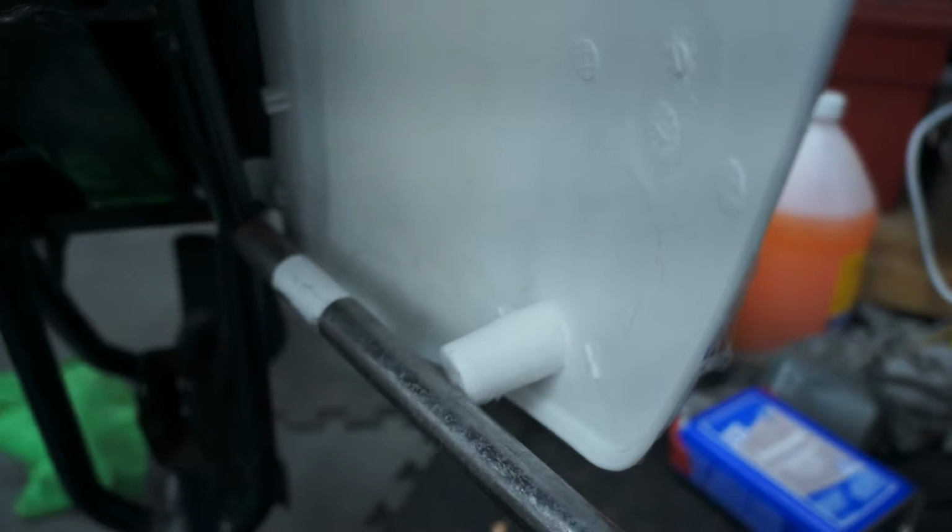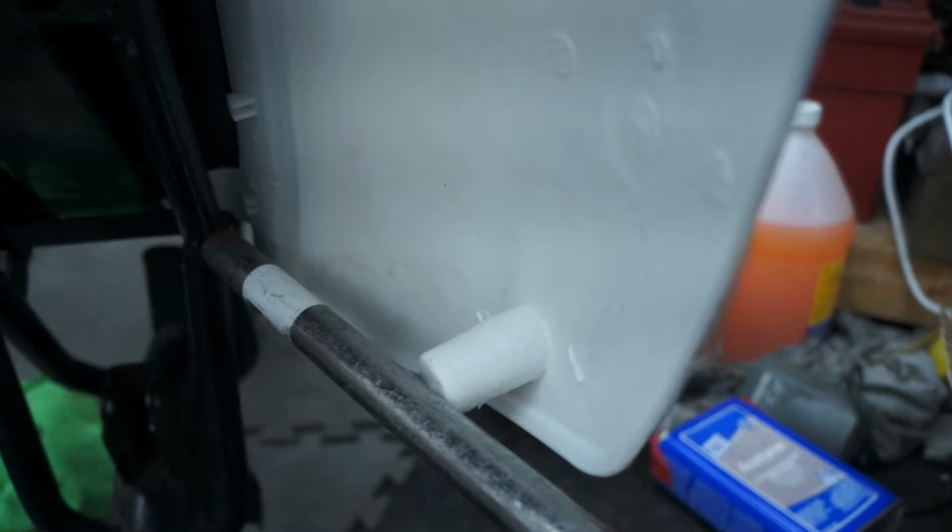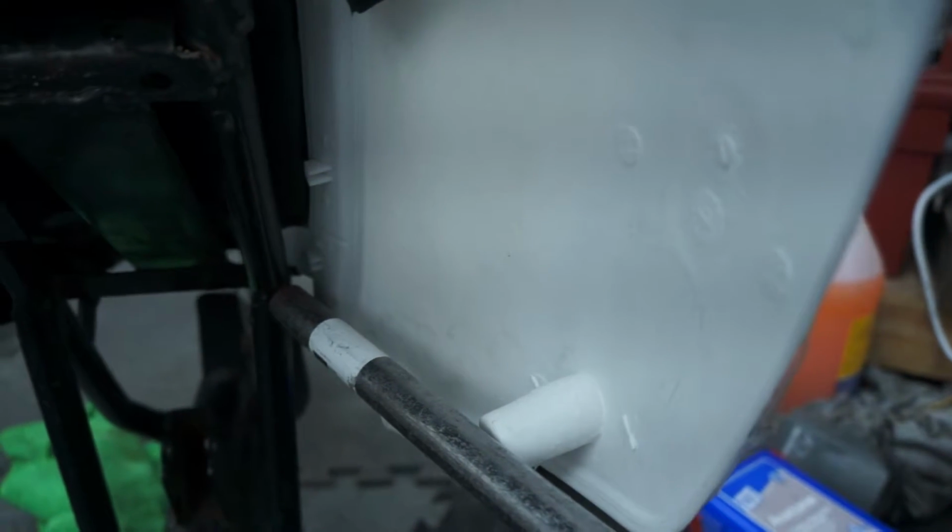I'll just weld on a little piece of the strap that I used for the rear fender, and just weld a nut on the back of each of those, and then it will just be a little bit more sturdy than using the strap to come to the side of the bike, so for when you wreck or something, it won't just bend. So I'm gonna go ahead and do that.